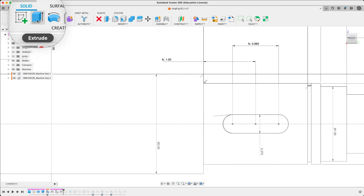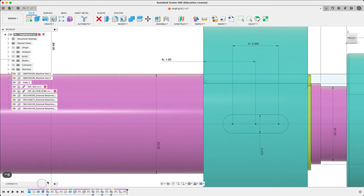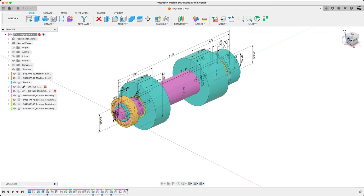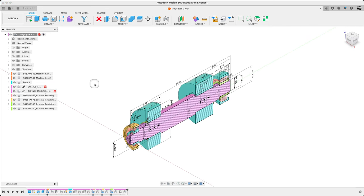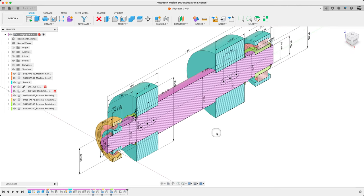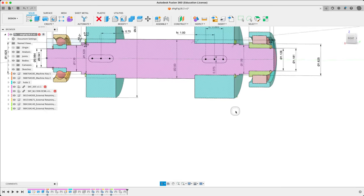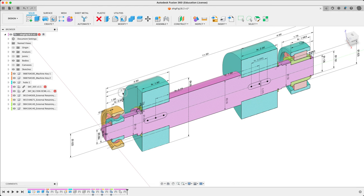So that's our final answer — the slot length plus an extra hundredth to give it some gap so we don't have it over-constrained. Let's have a look and see what we've got. Roll to the end of the history. There we go. That's a lot of work but not bad work. We've got a whole bunch of sketch going on, keys and slots and all the rest, good shaping so far, everything looking fine. The only thing left is to put some fillets and chamfers in.